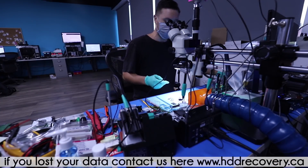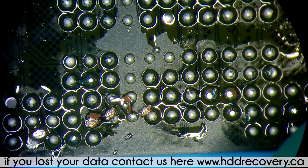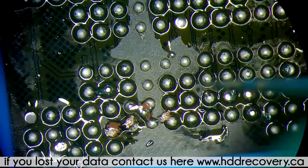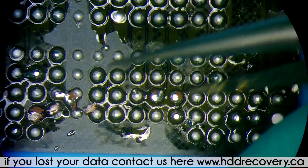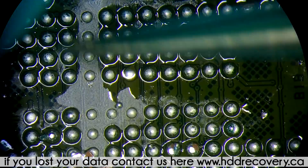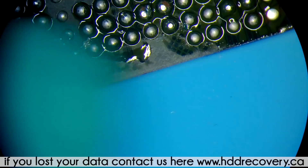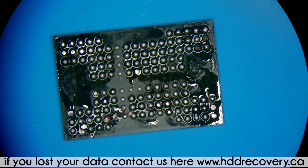Here you guys can see how damaged the board was. A lot of pads came off with the solder balls, and these would definitely need to be there — they're pretty essential. Anything inside of this grid is most likely carrying some kind of function. Same thing here — we need to clean it up and get it ready.